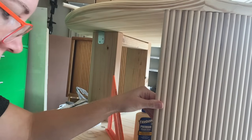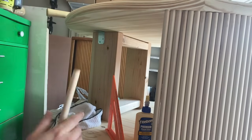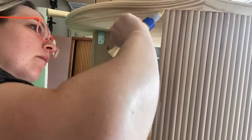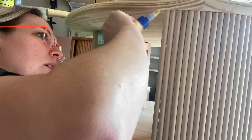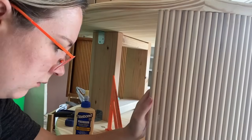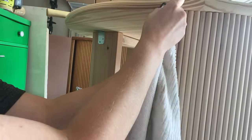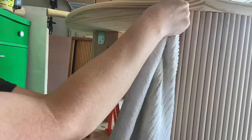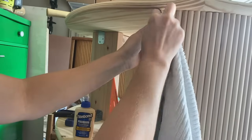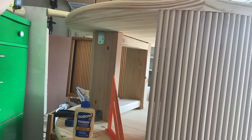If you've never worked with wood glue, this is important: anything that touches the wood does not absorb stain. So any wood glue drippings on the dowels or the tops — wipe off as much as you possibly can so it doesn't look tacky when you go to stain. The reason we picked up the solid color deck stain is for those touch-ups. When you go to touch up wood glue spots, you have to have a solid stain color or it just won't look very good.